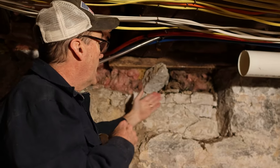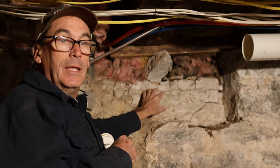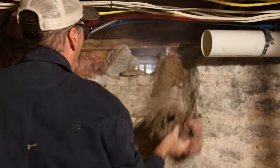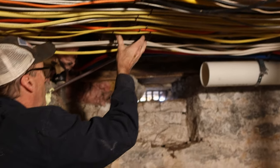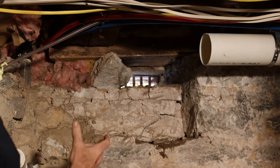Today we're going to break through the wall, put a powered fan on, and try to cover up the pipes. Here's where we're going to break through — fortunately, right here there was an iron grate that they took out years ago and attempted to backfill with stone, but it looks cracked and broken. I was naively hoping it breaks out easily. After pulling out some insulation — wait, the grate's still there, so I'm going to have to cut through it. There's also a major beam right here that holds up the kitchen floor and rests on the stone wall. So I'm going to put a jack in here to hold it up before ripping out the rest of the wall. Now we've got the beam jacked up — it's okay to start ripping out.